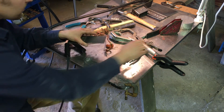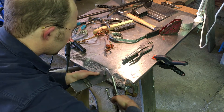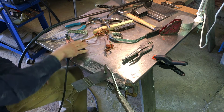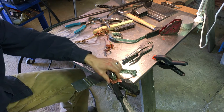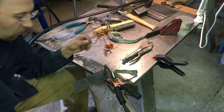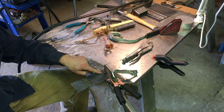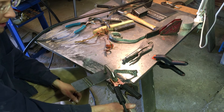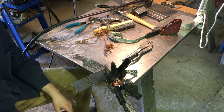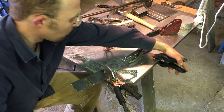Another option: if you're clamping your work piece to the table and that's a solid metal-to-metal connection, you can ground the clamp to the table, which then connects to the work piece. It's not always the best way if those connections are bad, but if it's set really tight — especially with added clamping pressure — that's a great way to get a solid electrical connection and avoid a poor ground.